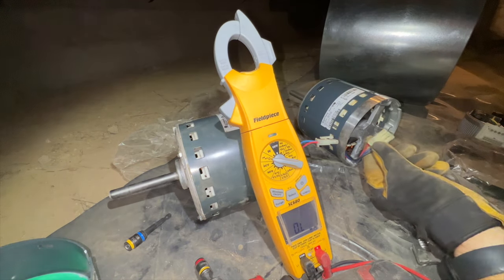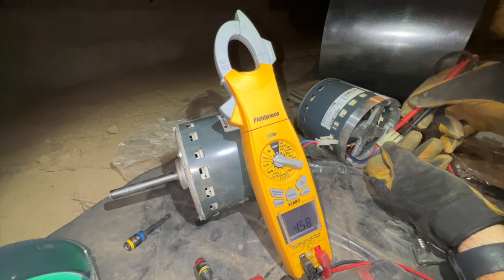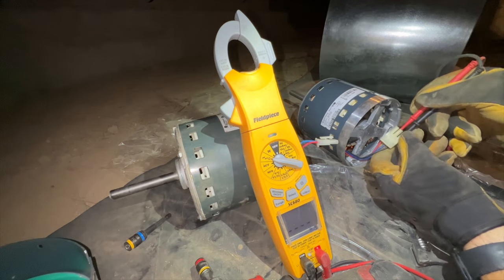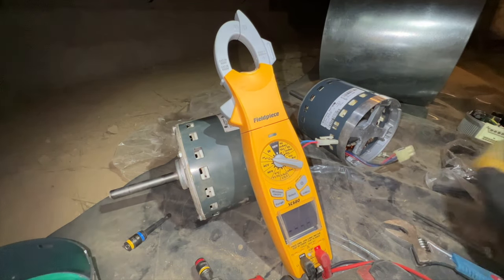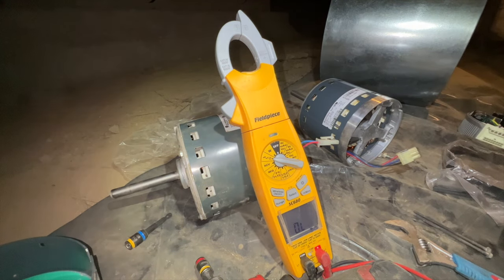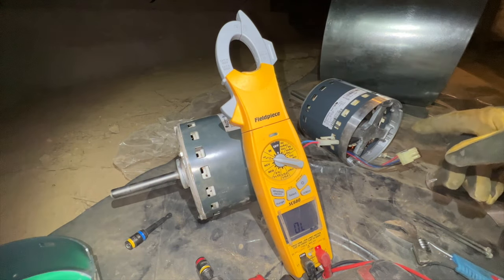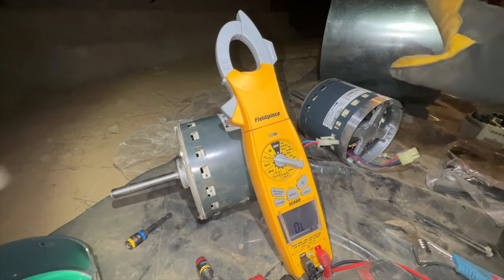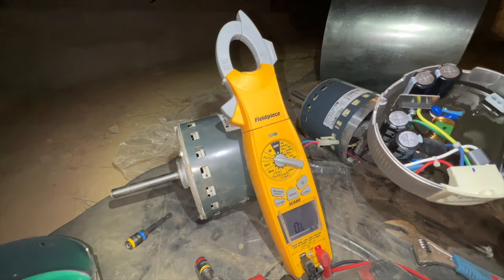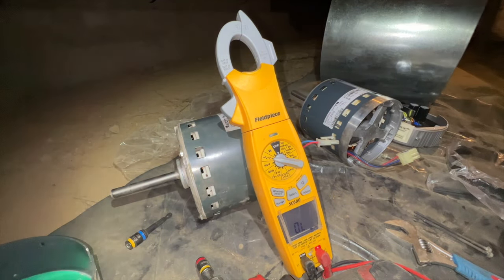Same color coding — red is one, blue is two, black is three. One to three: 4.59. One to two: same. Two to three: same. So the old motor is fine and the new motor is also fine. That's how you test these: if all three legs read the same, the motor is good. Just to be safe we're going to change out both to avoid a warranty callback. For this particular York model, the motor needed to be programmed for the fan speed algorithm, but it came preprogrammed.